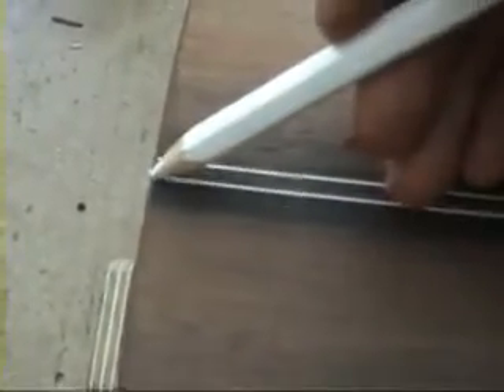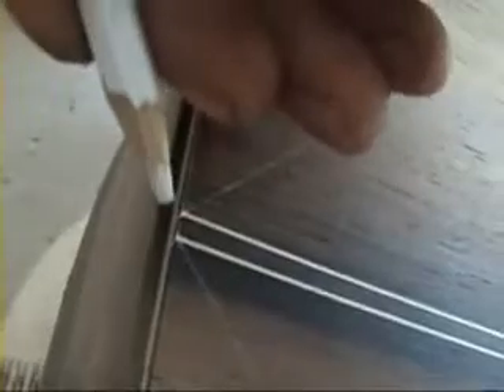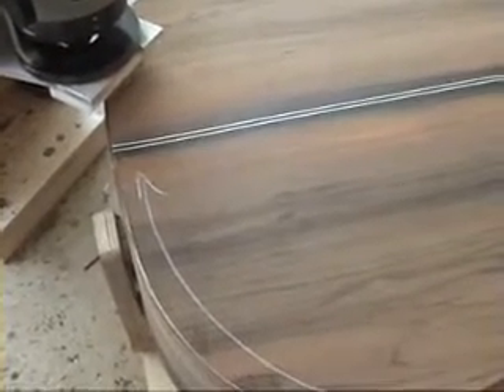Because my purfling is mitered, I can't just zip straight across with the cutter. What I have to do is stop shy, out of sight. I'll mark — trying to do this with a camera in one hand and a pencil in the other — I'll mark the white line about a millimetre from that centre strip. I eat away with the cutter. When the white line goes, I stop. I've marked some spots here. I'm going to cut those areas backwards. You've got less chance of it tearing if you cut backwards. Once I've cut backwards, I then cut around the whole thing forwards.